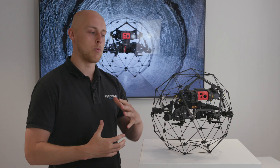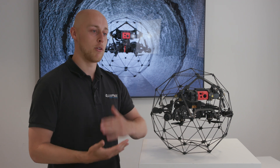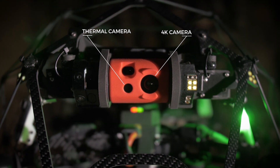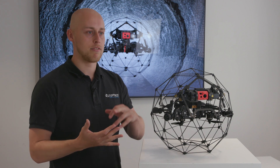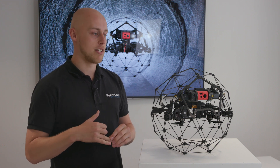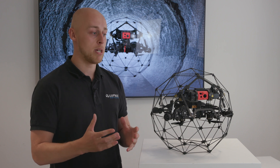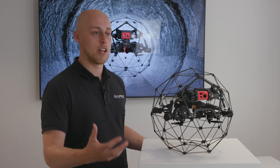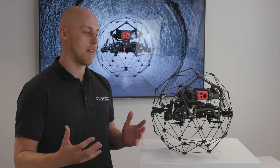Compared to the Elios 1, the actual visual camera has been upgraded significantly — you're now talking a 4K camera. For the likes of inspection, if you want to take that post-process, you can actually zoom in, which is brilliant for looking at cracks or areas that needed more detail but you couldn't get on the actual first job. It still obviously has the thermal camera, so for internal inspection — up close looking for leaks or even just to get your orientation — it's perfect.